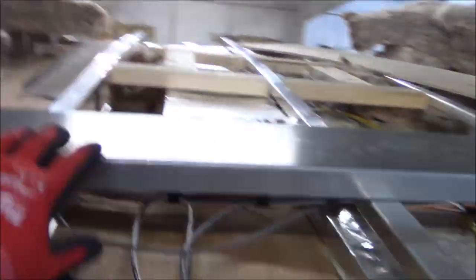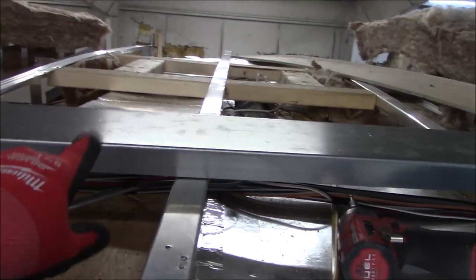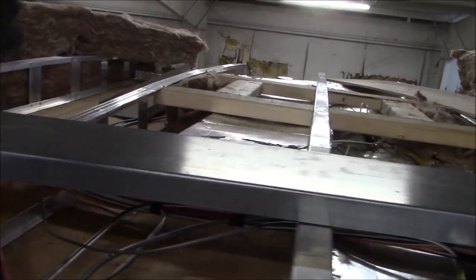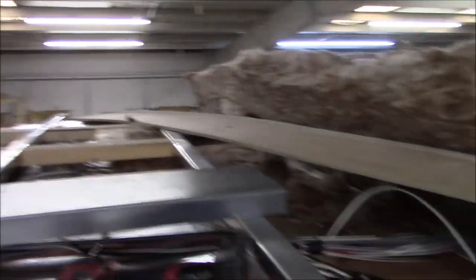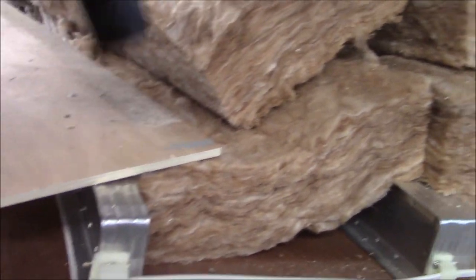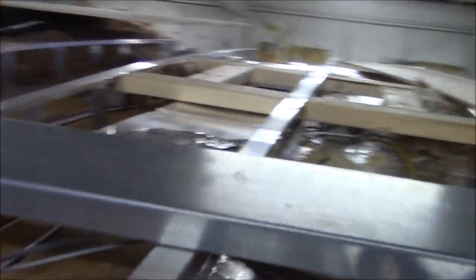We're checking all this and we're going to reinforce it with 16-gauge steel — we're going to strap it along right up inside there. That's structural steel right there. We're going to bridge it all the way across. I don't want to get into all new fabrication or trusses — it's not really necessary because of the way it spans. We're going to use all that framing and pull it all back together with the existing. It's just a piece of pipe they had in there for access for wires and stuff. Checking all the ACs and all the duct work — we want to make sure it's all tight before we put it together.